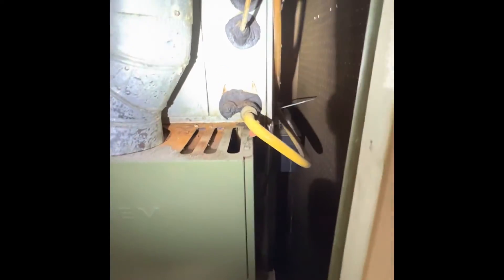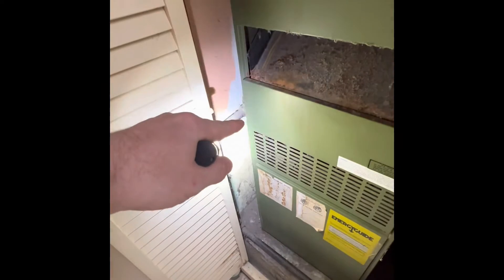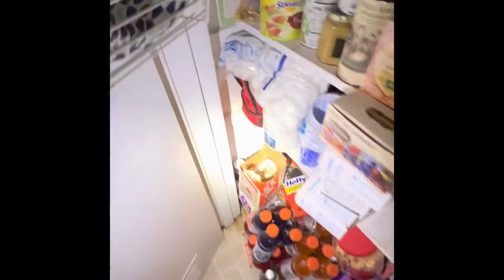There's travel on that side as well. Our connection goes through the attic for all of our main ductwork source, and it sits on a return base. We have a double return on that wall in the front room, a return on the base here, and this door has a return grill on it. Back behind here there's an additional return, and somehow through the slab there is an additional return behind our couch that's still connected.